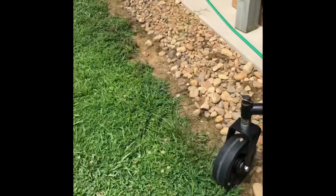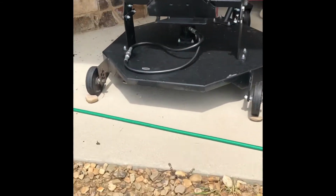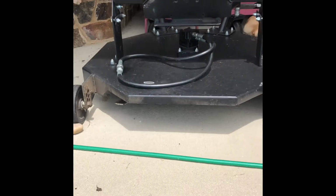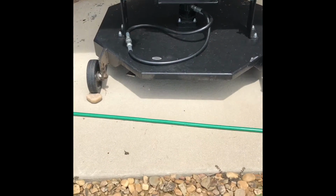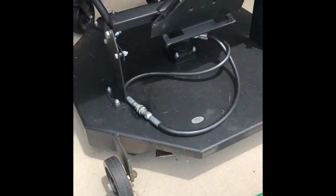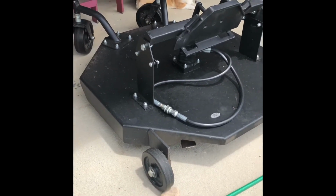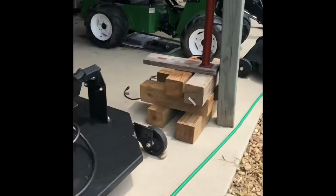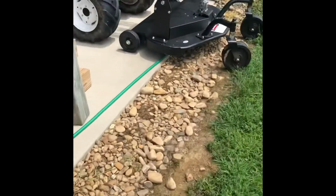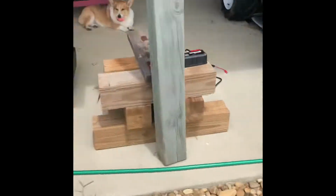The brush hog has the typical bush hog blades underneath that are on pivots. 2 big blades that will vary the spinning speed depending on what kind of brush they're in. If you hit something, it'll kind of bounce off of it, but it'll cut some pretty tall stuff. But it does protrude out from the machine a little bit further than the finish mower, and it's slightly wider, so it's not as good for getting into the tight places I use this for, around the pond in particular, but it does a great job.